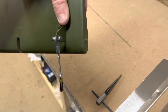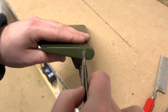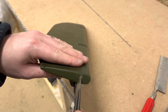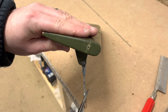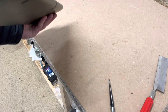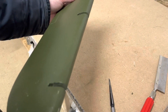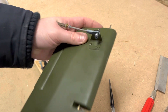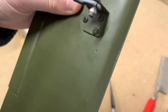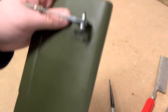And there we are - that is it, nice and flush and smooth. Then you can use a tool like this - a reamer - just to get the edges out there and open that hole up a bit better. There we go, it's nice and smooth. If we push the rod in from the other side we should get that nice smooth movement all the way through, then give it a little shove on the other side to push it through that end. Nice and smooth all the way through - no real resistance, which is what we want.